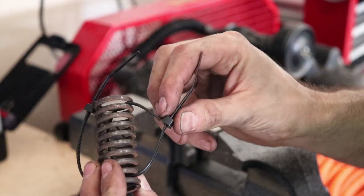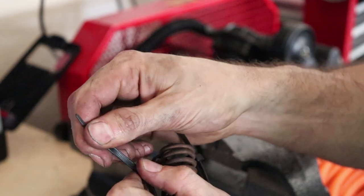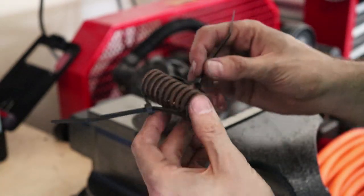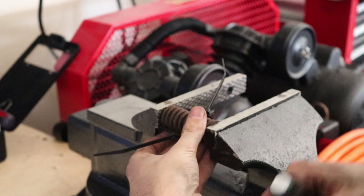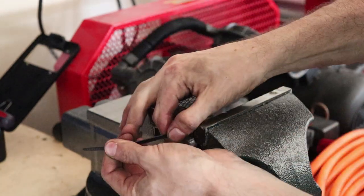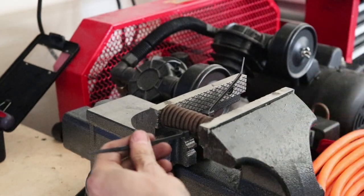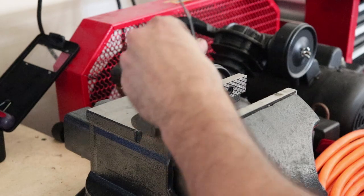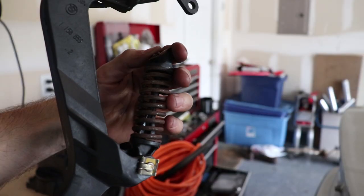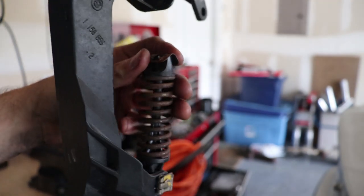Here's a trick: I put zip ties in between the spring before I put it in the vise, then once I have it compressed I tighten it down — these act as ghetto spring compressors. Be careful because it's going to be under tension so these things are not safe. Set it down, make sure it's nice and tight, and it should hold. Now it's under tension but it's smaller, so it should be easier to put back in. The order of the spring assembly is: that little lever, the spring, and this little cap piece — just force it in there to get it to lock.